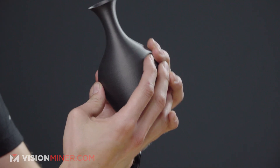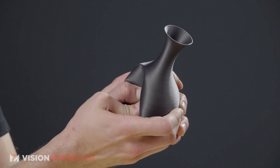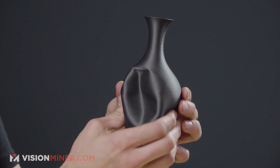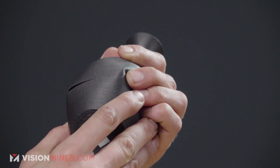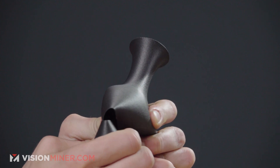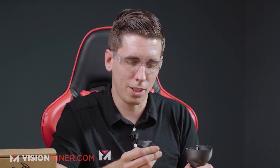The next break test: I'm just going to shove my thumbs through this vase and see how the material reacts. This was printed with a 0.4 nozzle at 0.6mm extrusion width at 0.2 layer height. Oh yeah — that's nylon for you. It's just deforming, not even breaking. The layer lines are strong, it's got great adhesion, and you can literally just crumple the whole thing up. Tough stuff.